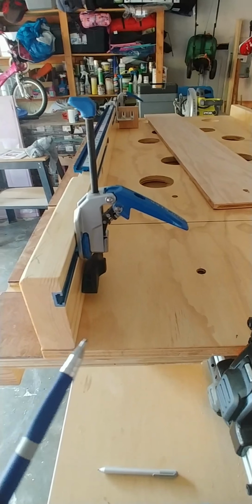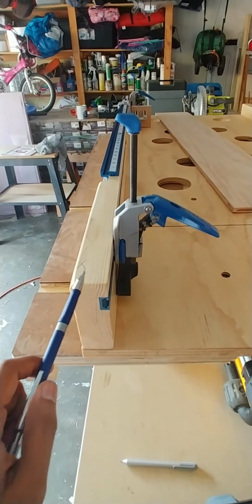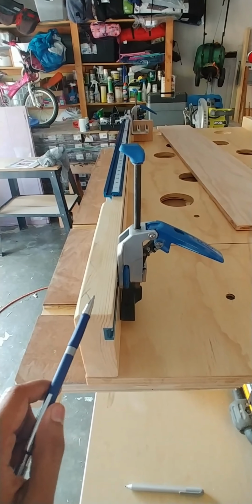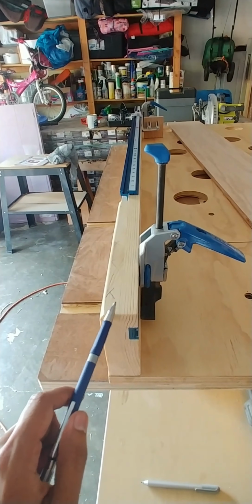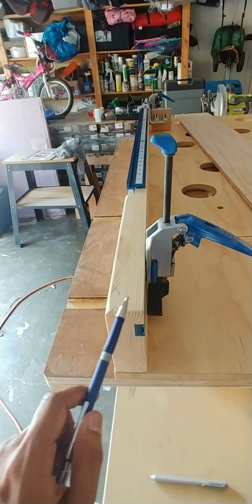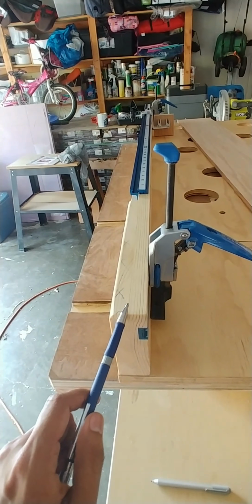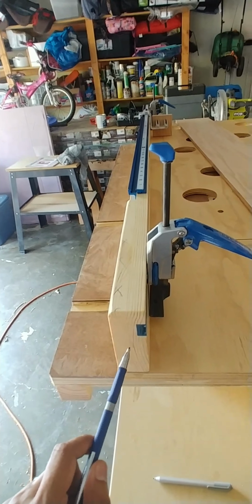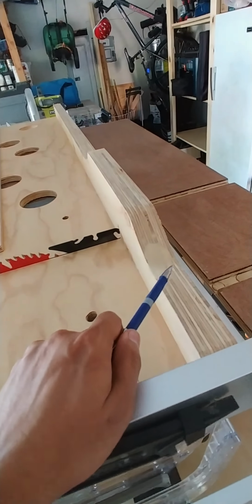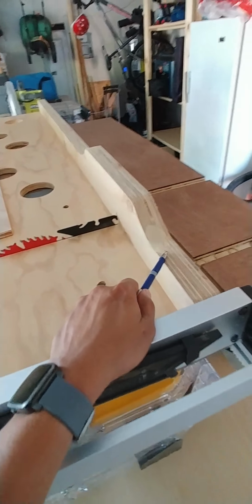And one aspect to make sure it's perpendicular is to use a fence that is extremely straight. I found out that I couldn't use plywood because it bends quite a bit, but I used 2 1x5s and glued them together and then cut 4 inches in height. The back fence, you can use anything you have. It could be scrap wood.